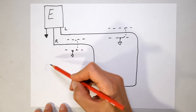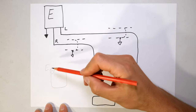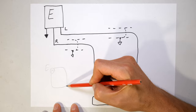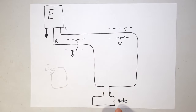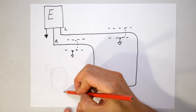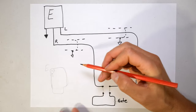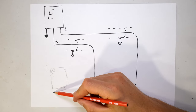Just to refresh: it's a series circuit. There's the energizer and the entire wire all the way back to the supply - a series circuit. By adding the gate, all you're doing is lengthening this, but still a series circuit. Keep that in mind, because some people think they can just add this in parallel.